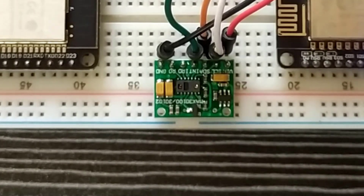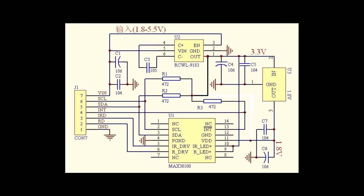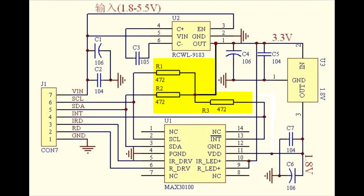I think we now understand the real problem. What should be the solution? Well, the solution is very simple. We just need to connect these pull-up resistors to the 3.3V network. That's it — that simple. But how and where to connect them matters.